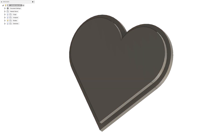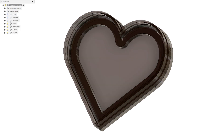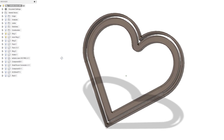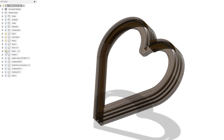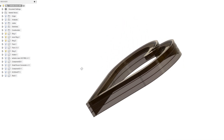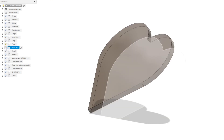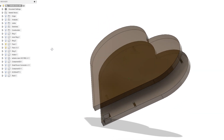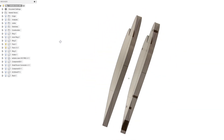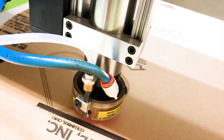Then I started the initial design in Fusion 360 by figuring out how many pieces I need. In my design, the LED strip is held between inner walls and outer walls. The walls are multiplied by three to accommodate the width of the LED strip. A top and a bottom piece are also needed as one-way mirrors. You can download the model and the vector file in the description.